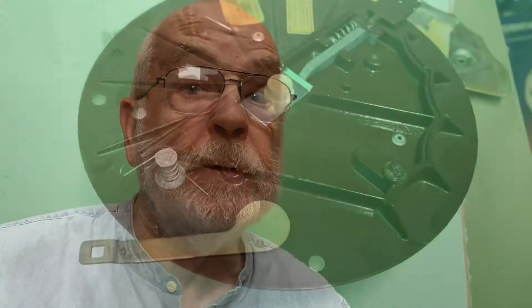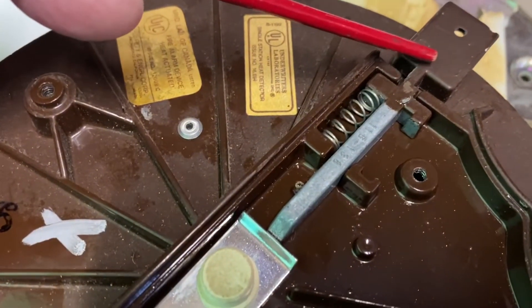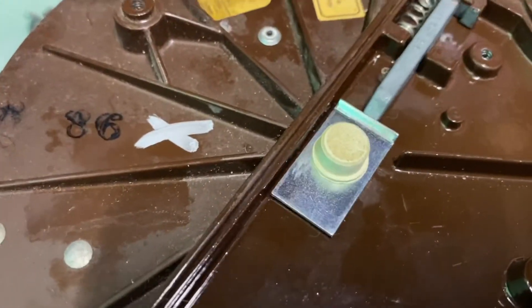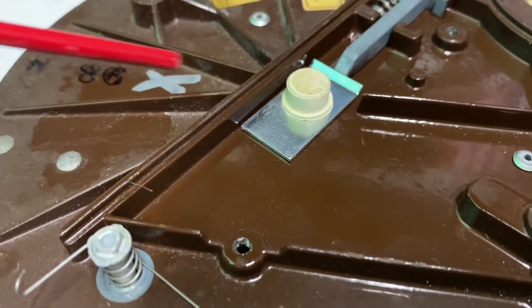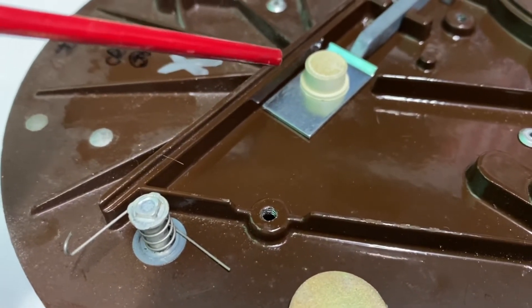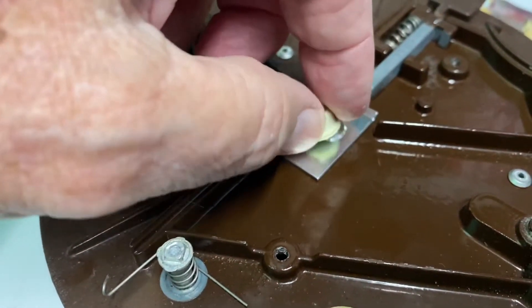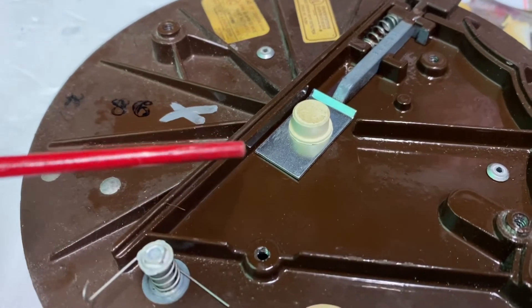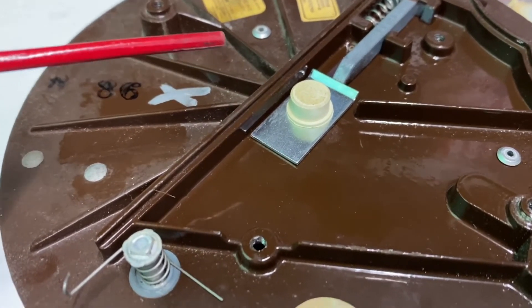I replaced the broken test button with one from a broken-spring unit, and it was very easy to do. Here's the back side with the cover plate removed. The test button pushes this piece of metal and lifts up the spring metal right where that white cap is, and that makes the bell ring. Removable pieces include the spring and the test lever. This little button is the one used to reset the wax in case the alarm goes off because of heat — somehow it reforms the wax to block the trigger mechanism until the next time it gets too hot.